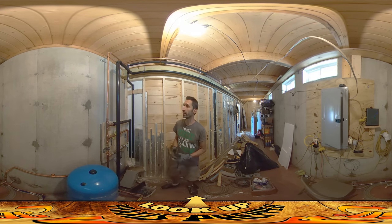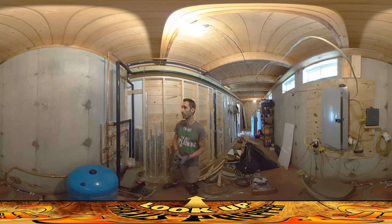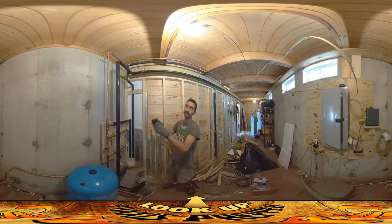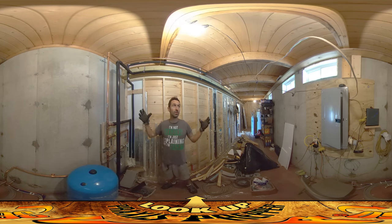The cold water pipe is a completely different reason for insulating. It's not because I want super cold crisp water at the tap, though that's kind of nice. The big reason I'm doing it is I live in New England — it's always hot and humid here in the summer. Humidity and moisture is a big New England thing. What humidity does on pipes when you have cold water running through is it condenses — water droplets, like on a cold drink you might have outside. That runs down the pipes, drips on the floor, gets into the boards, can rot things out. So I'm insulating both pipes to restrict the humid air's access so we don't get that.